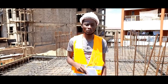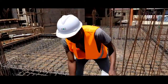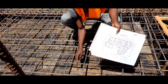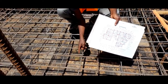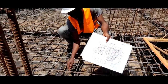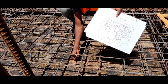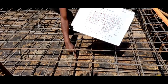I will start with identifying the bars that we normally use on site. From observation we have a double layer mesh here, and this is the topmost bar — it is called top one, we normally detail it as the top one bar. This is the second bar from the top, we detail it as top two. Below here we have the bottommost bar in our slab, detailed as bottom one, and the second bottom bar is detailed as bottom two.